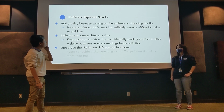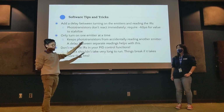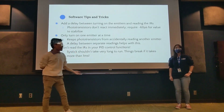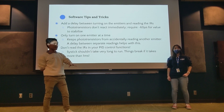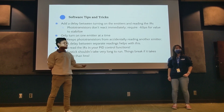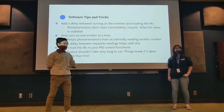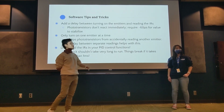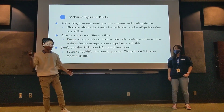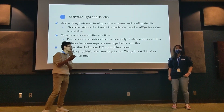I didn't actually talk about how it measures the voltage. Basically, how microcontrollers measure analog values, like 0 to the max voltage, is they use what's called an analog to digital converter. Specific pins on your microcontroller have analog to digital converters built in, similar to the encoder setup. It's built into the microcontroller, and we will just utilize that feature, and it will take that analog voltage and give us a value from, say, 0 to 1024 that represents that voltage.